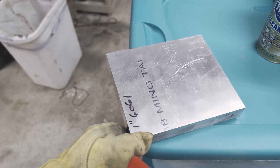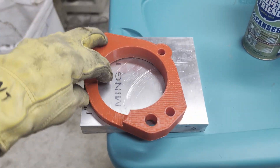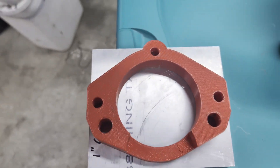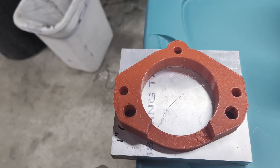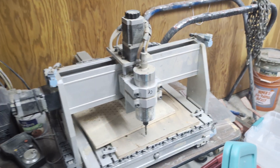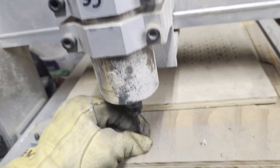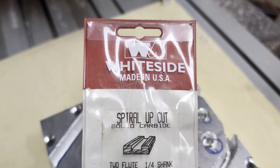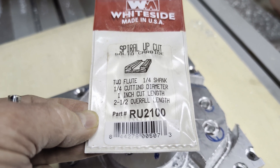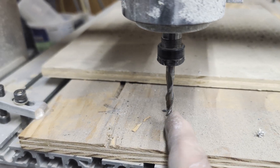The next step: I've got some 6061 aluminum, one inch thick. I made this part one inch thick, and basically I'm going to use my cheesy little Chinese mill to see if I can cut this part out of the aluminum. This is the mill I'll be using. I've been using it to cut some wood for a different project. I found these Whiteside brand solid carbide tips intended for wood, but I was able to use the two-flute version and cut some aluminum projects with it.